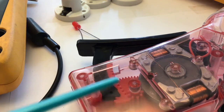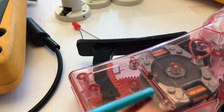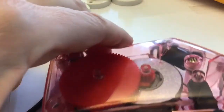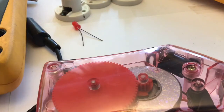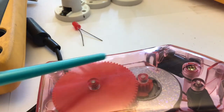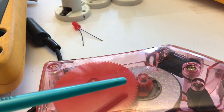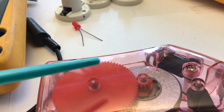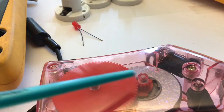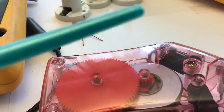This has about nine teeth. So every time I pump it, it moves this gear around once. This gear is connected to a gear underneath — I'm going to flip it over so you can see the back. There's this large gear here with about 73 teeth on it. So when this moves around once, 73 of those teeth will go past this point right here, and this smaller one has about ten. So when you push that black handle once, you've got about a nine-to-73 ratio, meaning this disc will move around a little more than seven times per stroke.